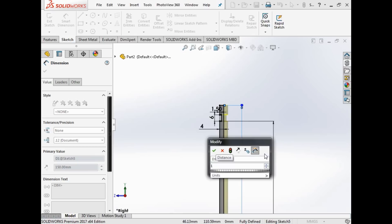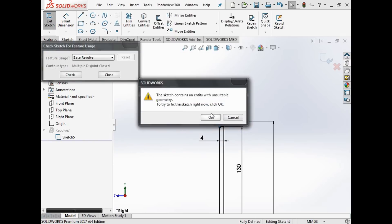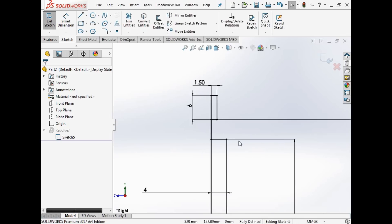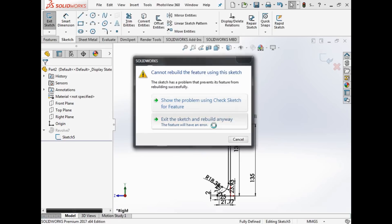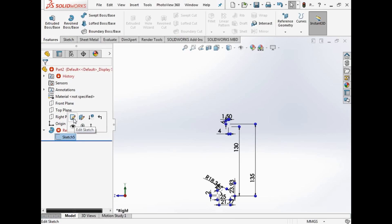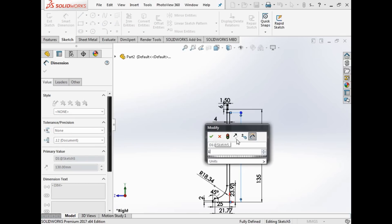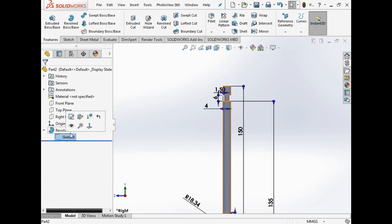If we go in and change to 130mm, we can do 150 minus 20 or just enter 130 — it doesn't really matter. But it says there's a problem: we've gone beyond the borders of the valve. The valve is 130mm but the collet recess is still set to 135. So if we fix that, it all disappears and we're like — what the hell? Sometimes this is obvious, but when you start editing more complex things it's not obvious what goes wrong, and it all loses its coherence.